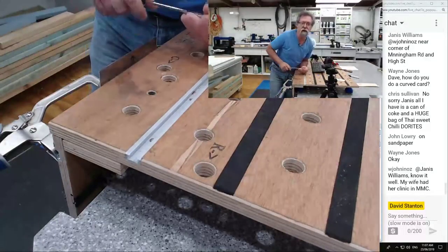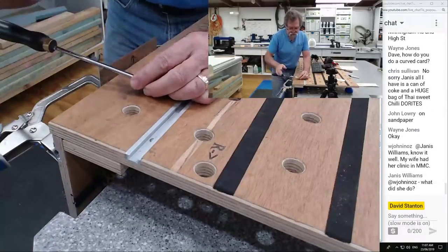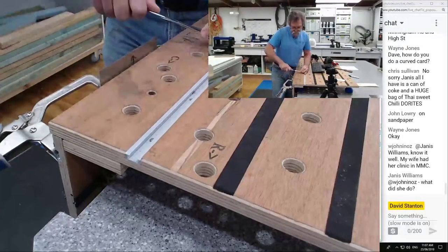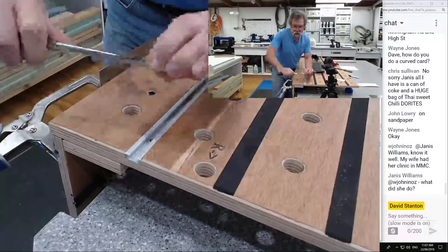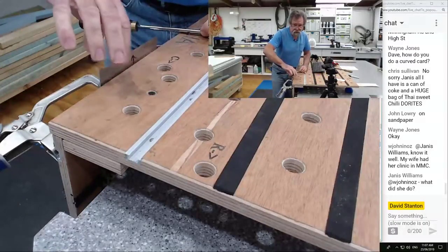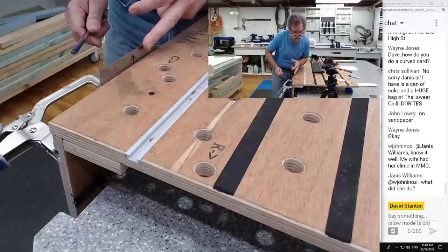All right, now what I'm going to do is draw a hook onto the side that I've already got marked. See, I've got that mark there. So we draw the hook by angling down at around 15 degrees. Depends on different things, but they say between 5 to 15. But let's pull it through at 15. Now, I can do this because the burnisher, which is this guy here, is much, much harder than this card. I can feel that already. You don't have to put a lot of pressure on it. We're not creating a massive hook that people can see. You can only feel it, you can hardly see it.